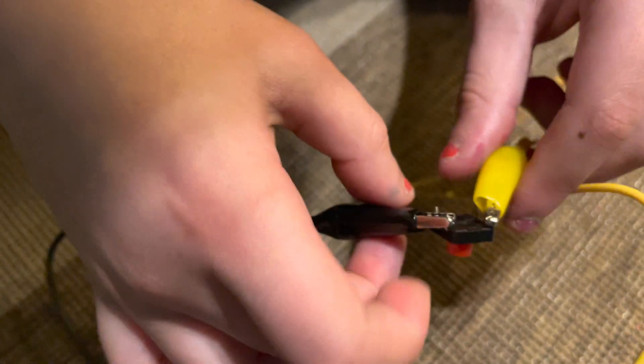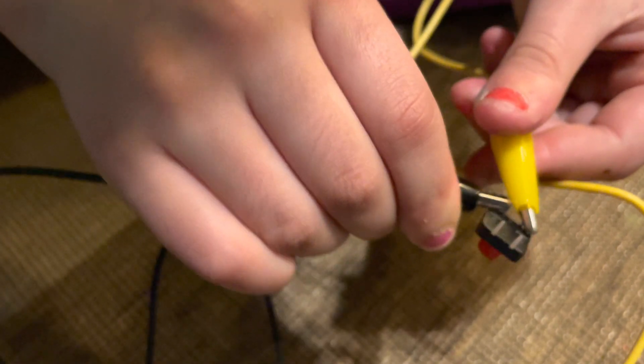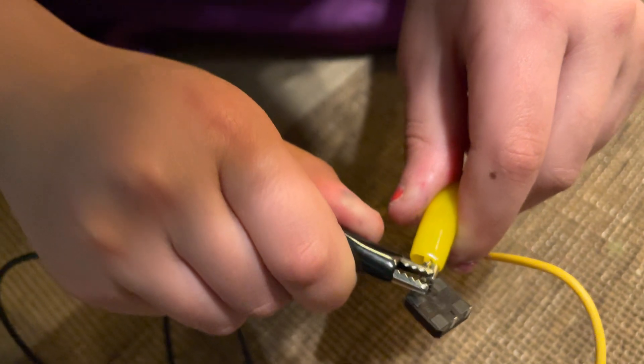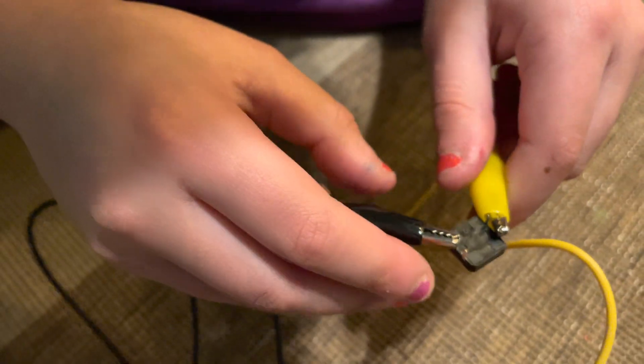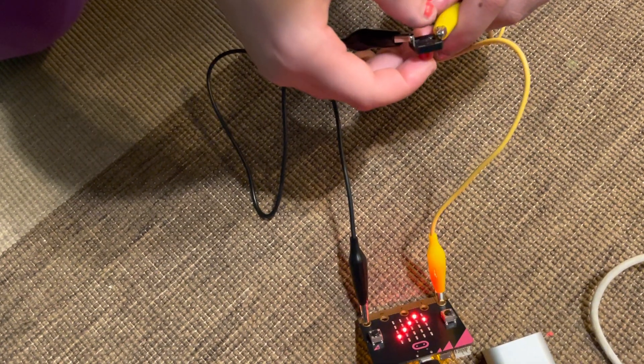You don't want to wire it like that. You want to wire it the other way so they're kind of on a diagonal from each other — that also makes it so the two wires don't touch. I advise doing it diagonally so they're separated, and then when it's pressed you'll see it lights up with a check mark.